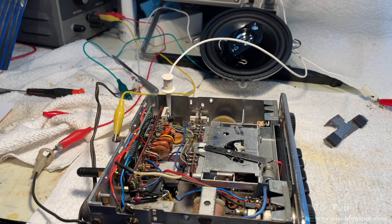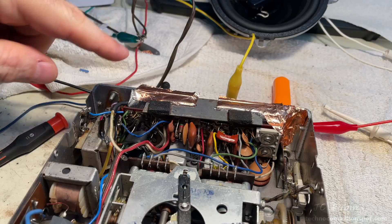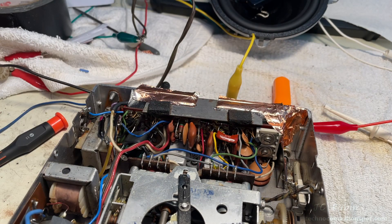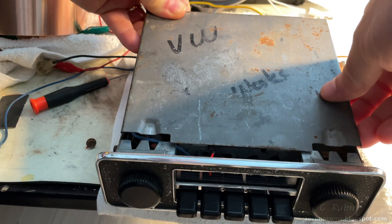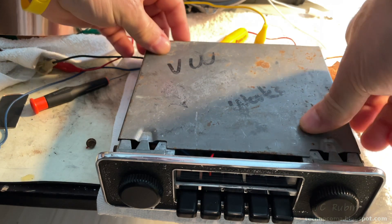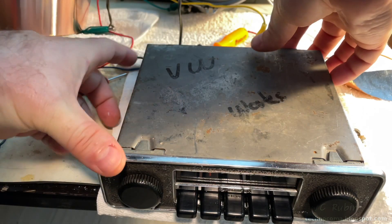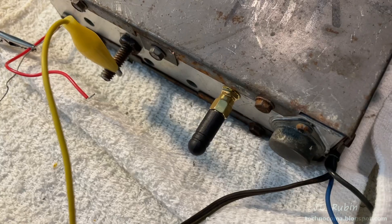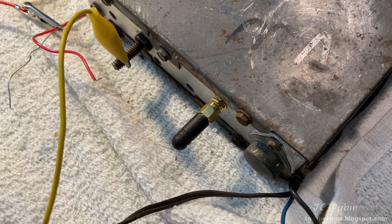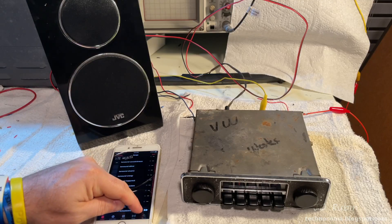That makes quite a difference. I installed it, and I further shielded the whole back section — this will be overlapped by the cover when it's closed with the screws. The cover itself blocks out any noise in the room that's not even ESP32-related, or noise that could be coming from the external antenna fed back into the radio, making the front end even quieter. The only obvious change to the radio is a small antenna coming out.